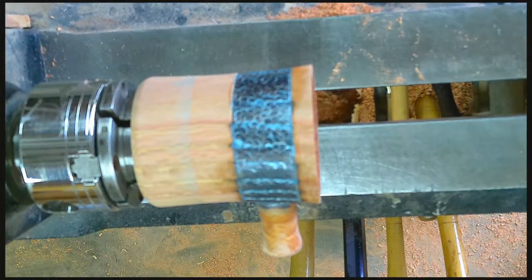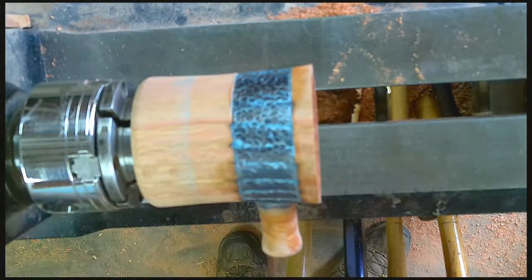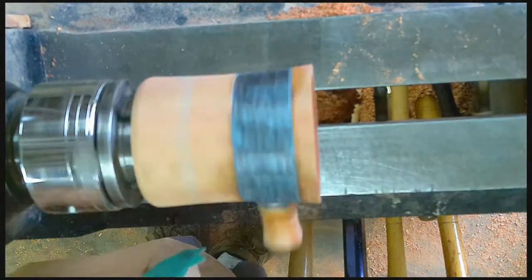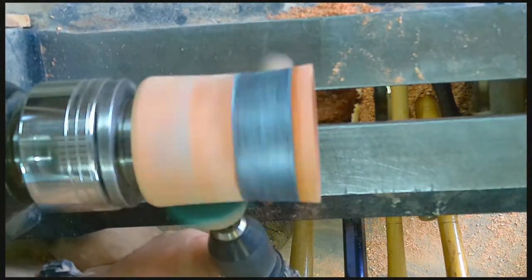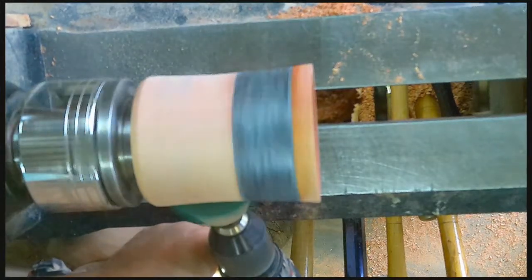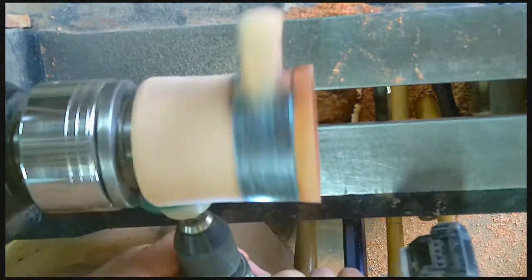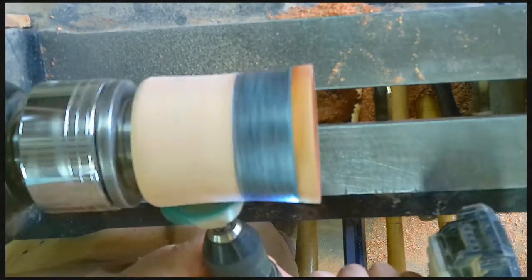Yeah, I don't wear rings. You notice I took my pedometer off. When I have spinning equipment, you're not going to see any encumbrances from three-quarter length down. It's not safe. And if I'm doing something where it's necessary to protect my fingers with gloves, I will only wear nitrile because that will tear. It's going to hurt, but it's not going to deglove my fingers.